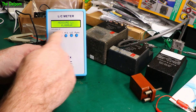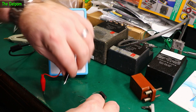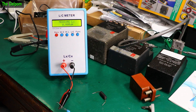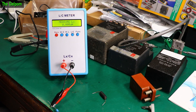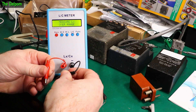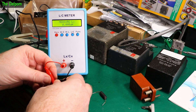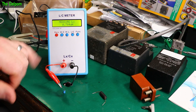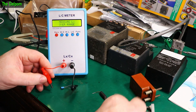So I'll plug the short in on inductance mode, and yep, it's measuring zero inductance. Let's find an inductor - I don't have any standard inductors, I'll have to get some one day. But anyway, this is a one micro Henry - apparently. It's not finding it. So maybe I need to re-zero the inductance mode, because it might be going below zero even though it's showing zero. Let's actually re-zero this. I'll try it again - there we go, that's slightly better. Obviously the leads themselves will be doing a bit of inductance depending on where these are positioned, so it's slightly low but it's there. My suspicion about the calibration point was correct.